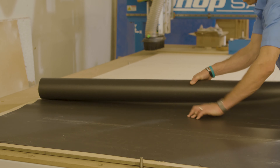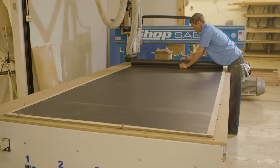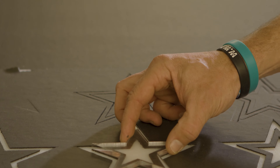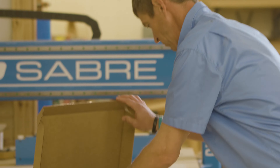Cover gasketing is the same material as our onboard gasketing, but instead of supplying it to a customer at 3/8 inch wide, for instance, we give them a full sheet of the material. The customer will use the CAD program they have to cut their small, intricate parts and will use the sheet of gasketing to make their own custom gasket.